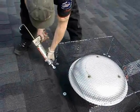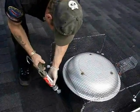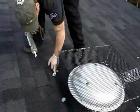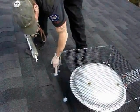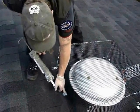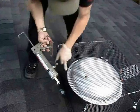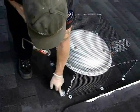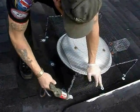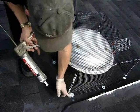I'm going to put some silicone over those washers, get around those edges, and also right over the top of the head of the screw. Make sure that we push that down so it makes connection with the roof. That screw itself acts as a cork when it goes through the shingles and through the roof tar itself — never, ever had a leak. But just in case, we always add a little bit of silicone right on there as well, because water will find a way in through the smallest places.